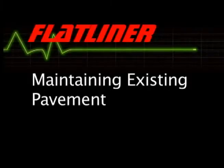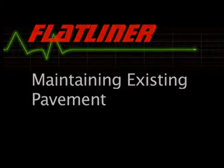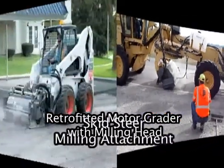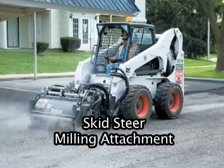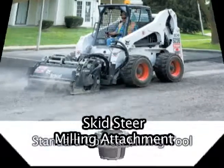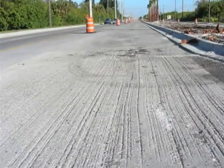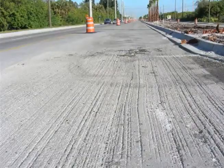All pavements will be subject to wear and tear. Many bumps or heaves will rise from adverse weather conditions, but often they appear because of problems below the surface, such as faulty joints and bad bases. The current solution for eliminating bumps or heaves is by milling them with retrofitted motor graders, rubber tire milling machines, and skid steer milling attachments — all of which use standard conical milling tools that fracture the surface.